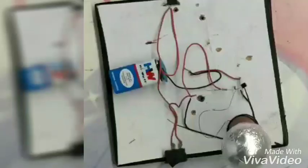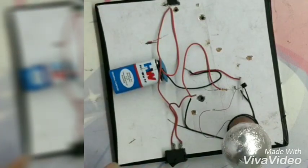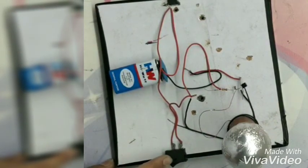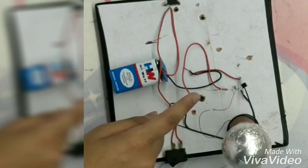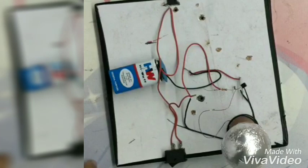So let's see how that actually works. To make this kind of setup, you need a 9V high-voltage battery and a switch which can have a regular two connectors. Then you should have a transistor of 2N2222A and a resistor of 22kΩ, and that would be totally fine for the setup.